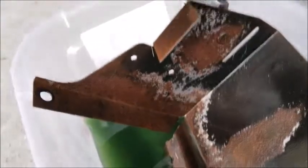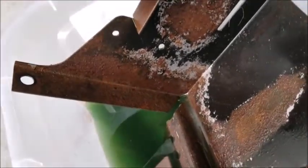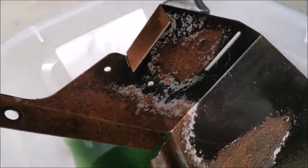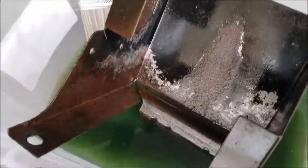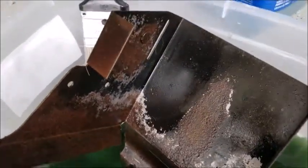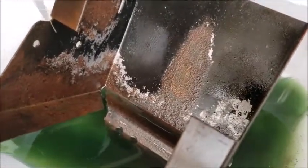After just a quick five minutes you can see the acid is doing its job — breaks the rust down and it just washes right away. You can see all that detail coming through. I don't have to worry about getting sandpaper in there. I'll let it soak a little longer, put another coat on, and maybe give it a light wire brush to remove more.